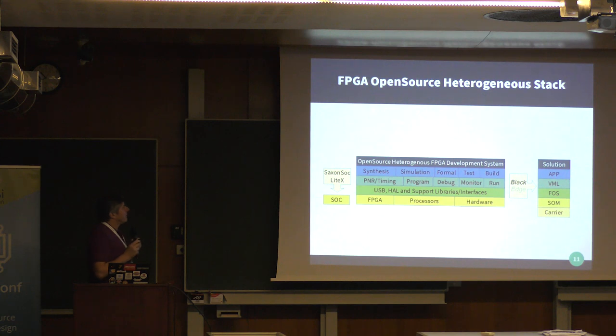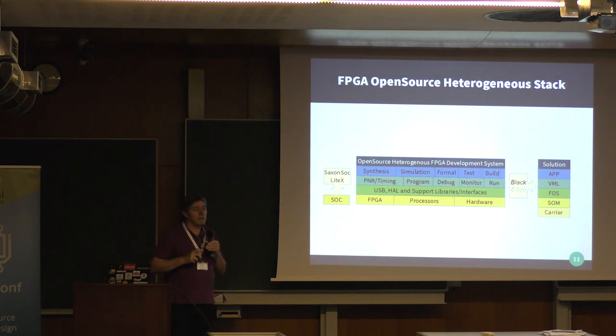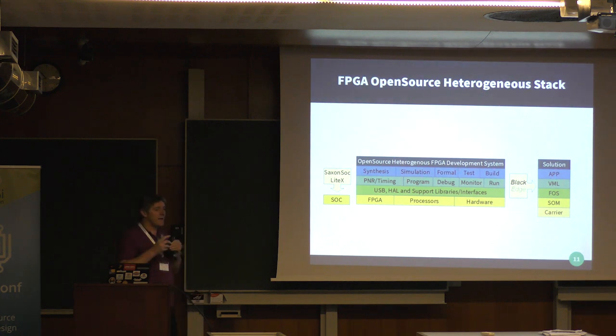From a development point of view, many users are using things like SpinalHDL/SaxonSoc, Migen, and nMigen, as well as traditional Verilog, producing systems on a chip. On the other side, we're trying to appeal to people building products who take a system on a module — like the Ice Core — and place it on their own carrier board. Along with the carrier hardware you need a basic operating system, maybe a virtual machine and libraries. At the moment we provide simple C or C++ libraries with software running on top.